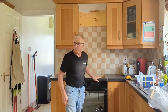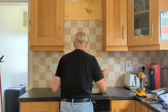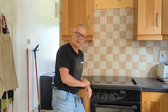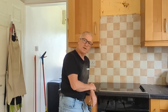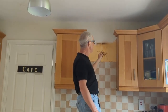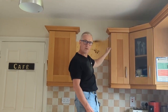That's my worktop in position. I'll just pick up my hob — this guy. There's the worktop, there's the hob sitting in this position there. I hope that's useful just for taking out the aperture, just to show how it's done. Drill the holes from the top, invert it, join the dots on the back, and cut it out with a jigsaw or a small skill saw. All I can do on top here is cut the straight length, create a mitre for the piece to return, and I'll make some sort of dummy at the back there with the same angles just to finish it out and bring it back to the wall.